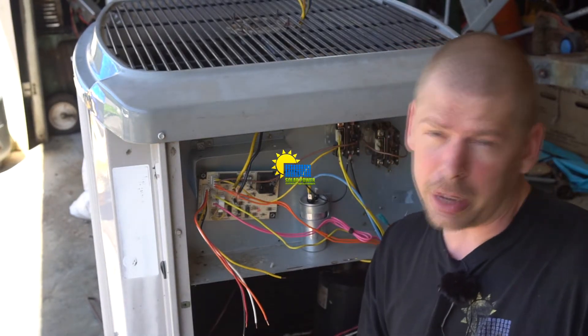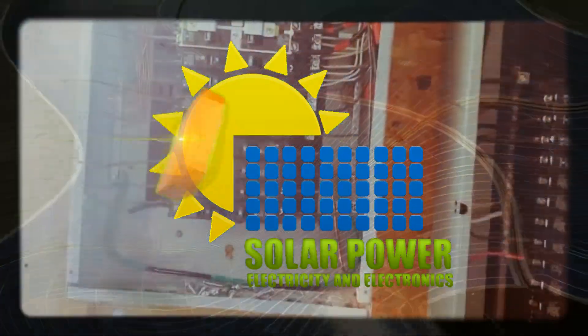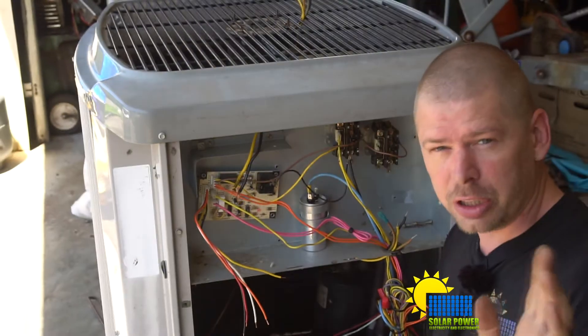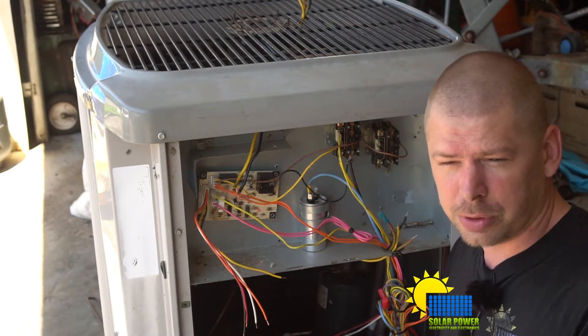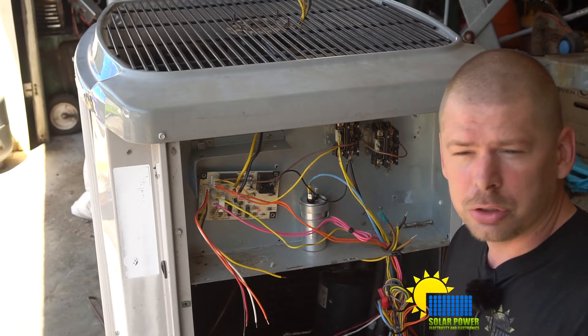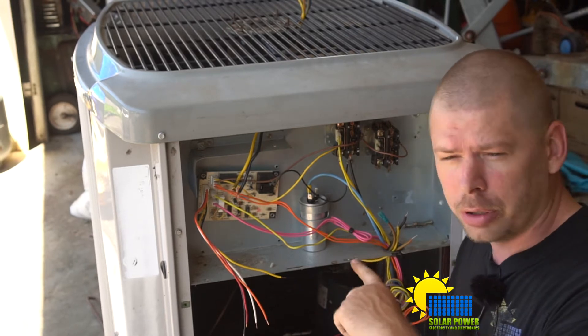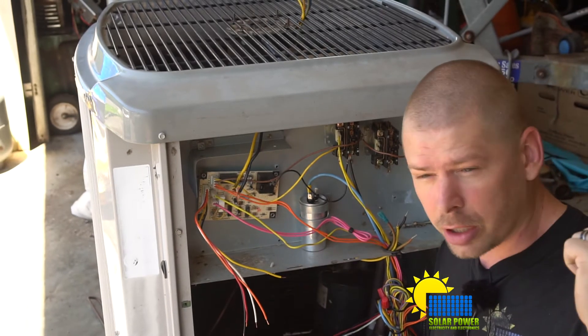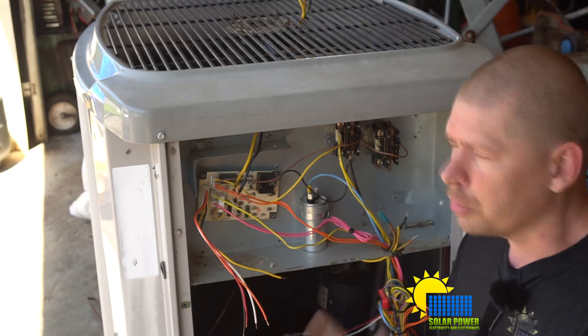What's up ladies and gentlemen, YouTube, everybody out there - it's Phil 20 and I'm back. We are almost completely done with our outdoor unit. I'm going to make a different kind of modification that sounds unusual to a normal residential unit, but it's only just for demonstration purposes. I don't have 24 volts in here, but I also want to run a 115 volt transformer to run the fan. I've got a 115 volt transformer and a 24 volt transformer, and I'm gonna get both of those installed in here.